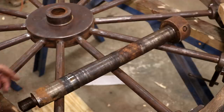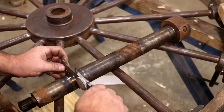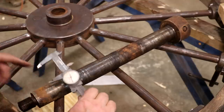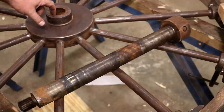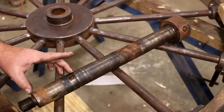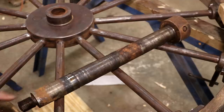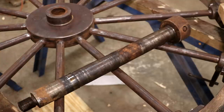Let's take a look at this shaft. This is the taper right here — I'm just going to get a quick measurement. We're at 1.845 on one end and 1.932 on the other, so roughly a hundred thousandths taper per that distance. I noticed when we took it apart the shaft was about a quarter inch from being flush at the top. I imagine this is the same taper we have in the other hub, which is good because I'm going to have to recreate that taper. I can actually use this shaft — it's got centers on both sides — I can put it on the lathe and adjust my taper attachment to match using a dial indicator. I was really concerned about figuring out what that taper was, since the hub is too big to put on the lathe, but having this shaft I can definitely work off of it.